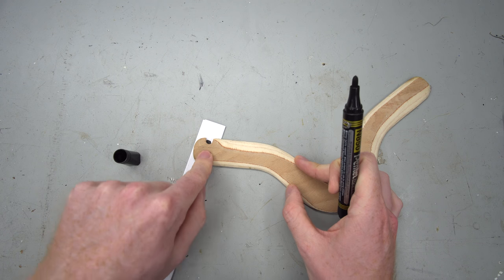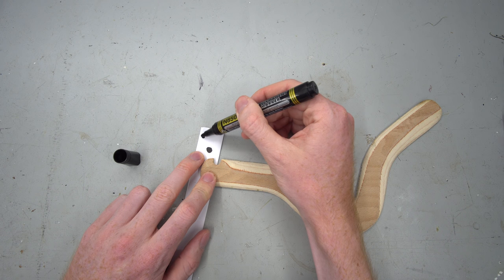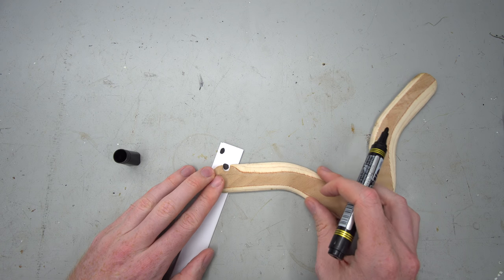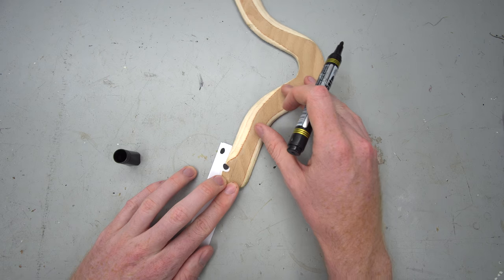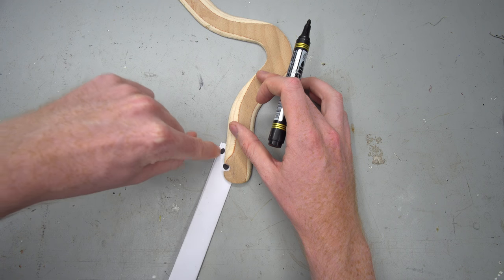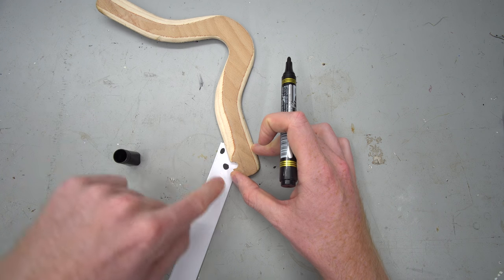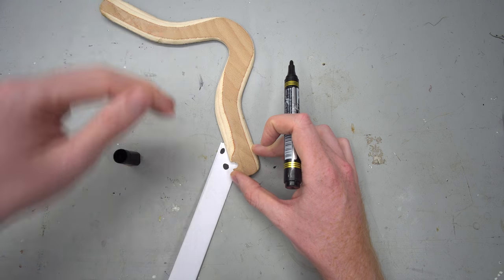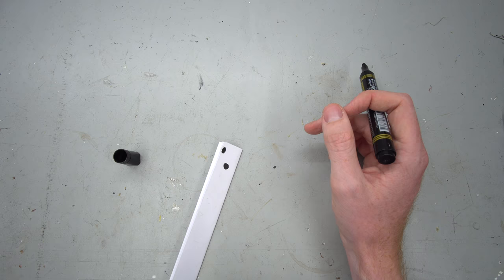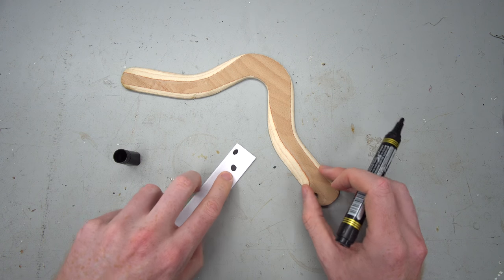So the way to make it release from this axle right here is to add another one about here. So basically, as the boomerang swings around, as soon as it touches this secondary axle, instead of pivoting around this axle, it now pivots around this one, which means it will unhook the axle which is causing it to stay attached to the arm, which will mean it will hopefully rotate and disappear and, well, hopefully come back. But that's basically how the release mechanism works.